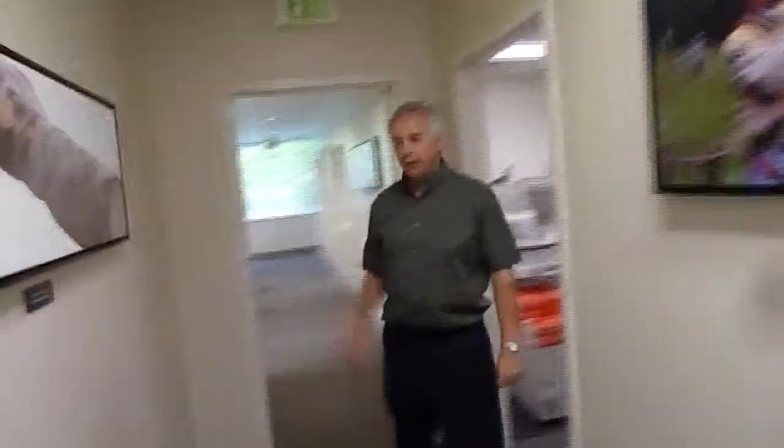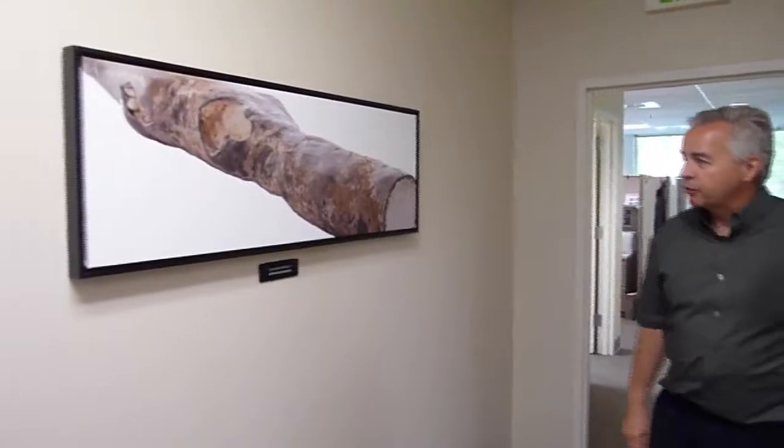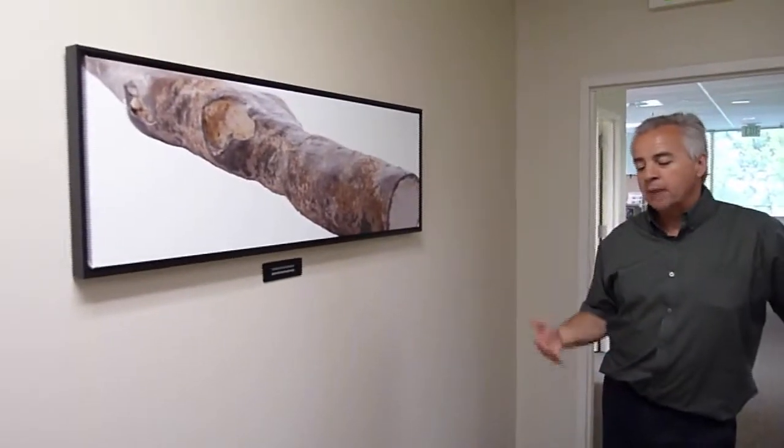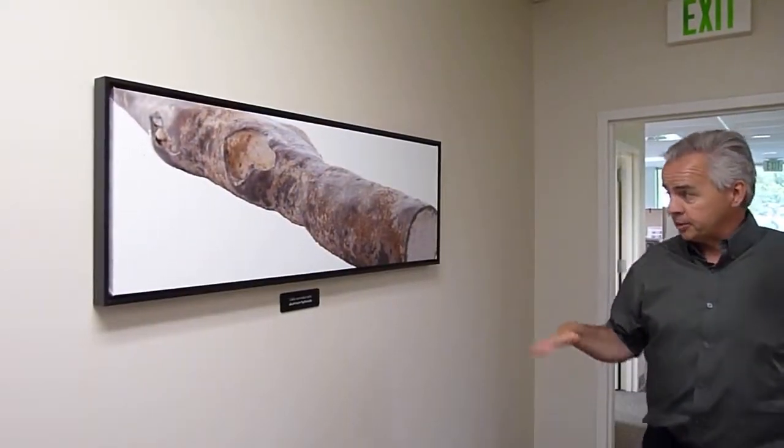And swinging on to the other wall, all the cables that we've looked at so far are all primary cables. So primary means a voltage typically several thousand volts to 25,000 volts. This is the kind of cable that might run to your house from the transformer, the decorated transformer that we saw before. They're called secondary cables. And it carries 110, 220, or 440 volts typically.